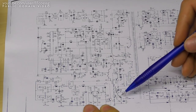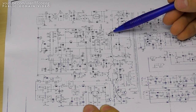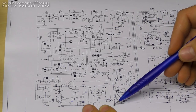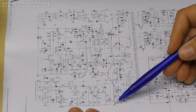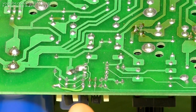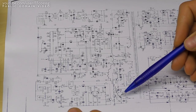different potential spots, because this is pretty much at the full potential voltage of the main rectifier cap, that's about 400 volts, and that is why the component, if you can read that, is a 400 volt capacitor. And this is what I am pretty sure is ground in the same circuit. So we've got almost 400 volts across that, maybe a two millimeter gap, which is way too much. That would not be deemed safe if it were between primary and secondary.